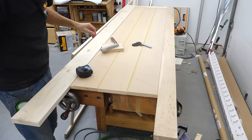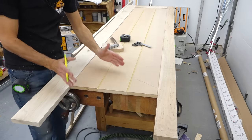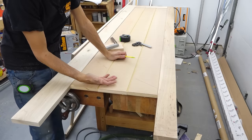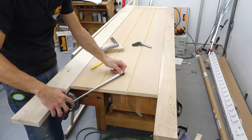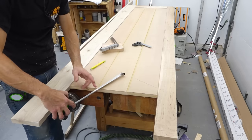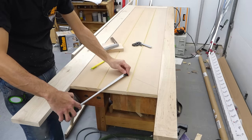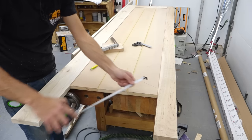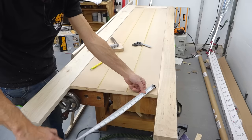Maybe. Okay, so for some fun here, just to further visualize things, I'm gonna go ahead and cut the skirt board. I'm gonna make that skirt board out of the MDF material because it's gonna be pretty wide. I need to get all the way down here into the very corner of the rise and tread of that first step. So I think it needs to be at least 7 inches wide. I'm just gonna go ahead and make it probably more like 9 or 10 inches wide.